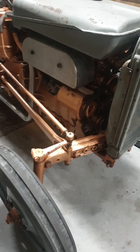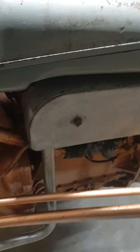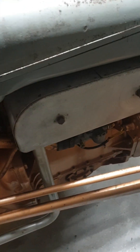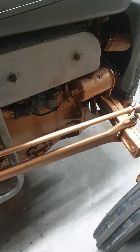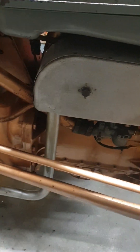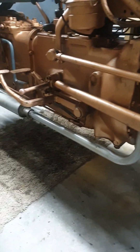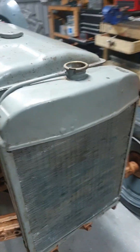This is as far as I've got this evening putting it back together - it's nearly just about fully back together. I just put on the heat shield; I know I didn't need to, but if I get it running I want to get it running on kerosene and TVO fairly quickly so I can get that head gasket good and warm and get it to start taking shape to where it needs to be to help seal it.